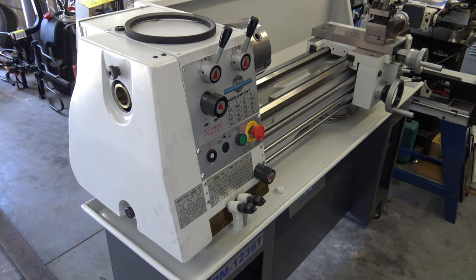When you first put the chuck in, don't over tighten all the cam locks the first time around. You want to make sure they all get seated properly the first time around. Then you can come back and snug them all down. Now you can see the notches between the two arrows on all the cam locks.